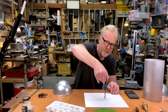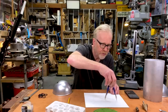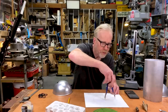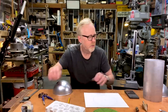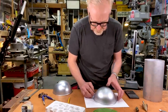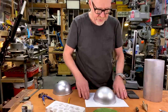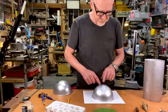A good drafting compass is so important. I'm going to make a series of small lines in case I wasn't quite perfect about my measuring — just to make sure I've centered my ball. It's not quite perfectly round, but it is round enough. Now I want to make an XY axis and find the top dead center of this thing.